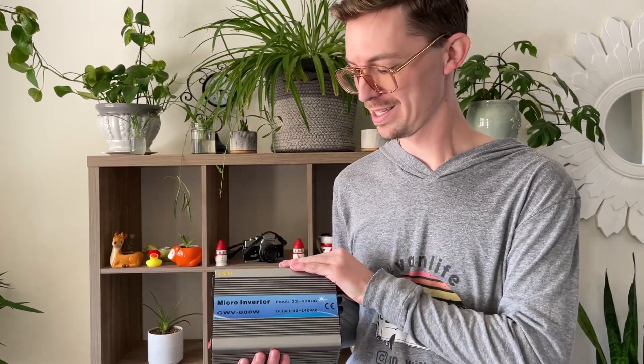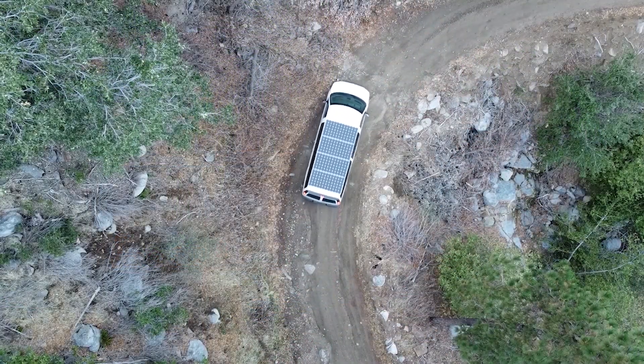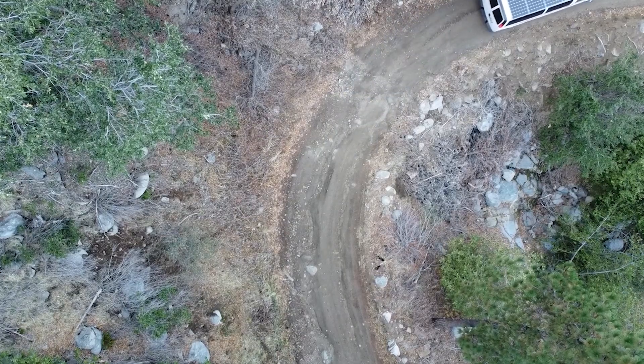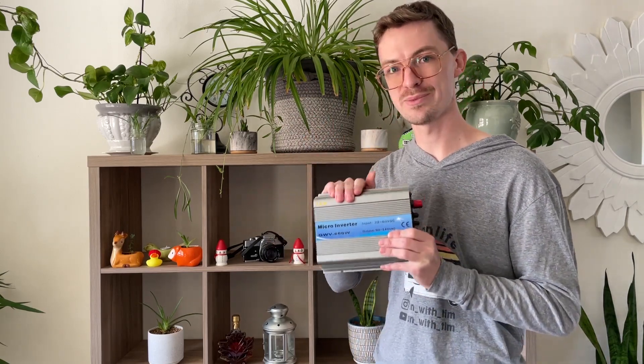The other side is just the output — it outputs 90 to 140 volts AC and matches to your grid's output, also matching to 60 hertz depending on what the power grid supplies. As for why I'm going for 600 watts and not higher: I have 920 watts of solar, but realistically solar panels never produce as much as rated. It's very rare for me to see over 700 watts, and anything over 600 watts only occurs at the very peak of the day. In wintertime when the sun's not directly above, it won't even reach that. So 600 watts is fine.